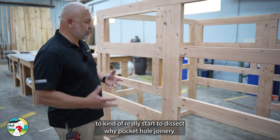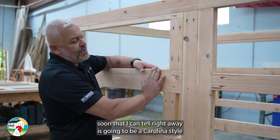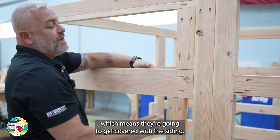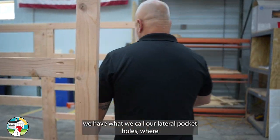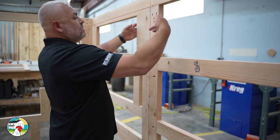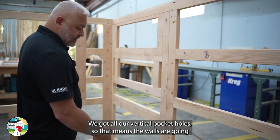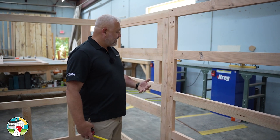We're inside the shop. Here are some walls up — this is actually a brand new coop coming out soon. I can tell right away it's going to be a Carolina-style construction because a lot of these pocket holes are on the outside, which means they'll get covered with siding so the inside looks even better. Inside, we have what we call lateral pocket holes, where the customer uses these holes to quickly screw their walls together. We also have vertical pocket holes so the walls get screwed right down into the base — as quick as the joint is, it is extremely strong.